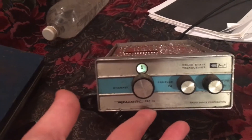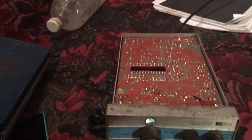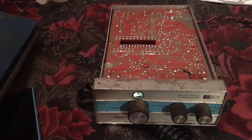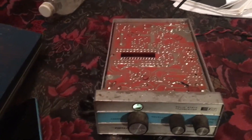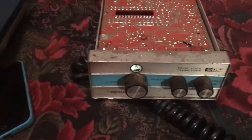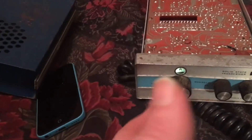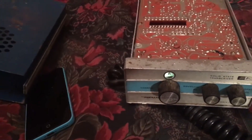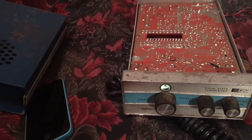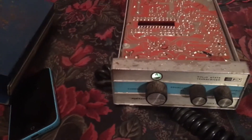This was made back before 1967 by Radio Shack Corporation. This is an old CB radio. It wasn't until 1958 when they came out with the Class D license for CB radio. Before that, CB radio was UHF — 460 to 470 megahertz — expensive radios at the time. So when Class D came out and made it affordable, they started making radios like this using the 27 megahertz that we know and love today — which they actually took away from the hams from the 11 meter band. But the hams don't really complain about that anymore. They might still hate us.